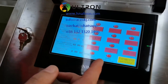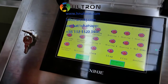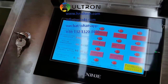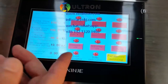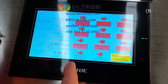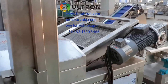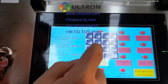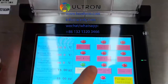This is the home page and we can set up all the parameters here. We can monitor the operation of the machine on this screen and touch this button to go back to the home page. We can also set up the temperature here. In this part, you can control all the functions — the red button means close. For example, to start the conveyor, press this button and the conveyor starts operation. We can also adjust the operation speed here; you can see the conveyor speed is increasing. Then we stop it.